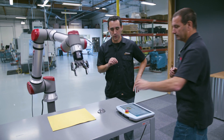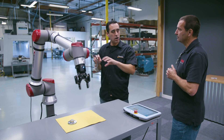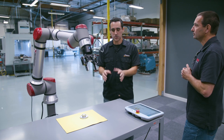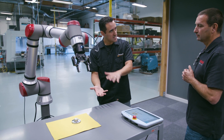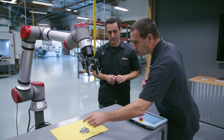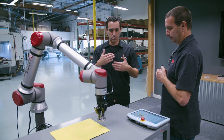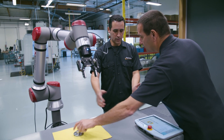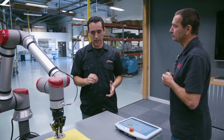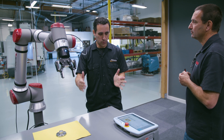So this solves the big problem I had four years ago. Every part I had, I made a plate with pins in it, put all the parts on it, and the robot would just go to where I told it regardless of whether the part was there or not. This is so much more simple — I can just put the parts on now. Is it a plane? Can I do stacks? You can do stacks, you can do planes, you can be at a different angle — it doesn't have to be planar. This alleviates all that pain. You could have multiple parts and the robot sees every single one at the same time. So I could load up a blue bin — maybe 16 or 20 parts — and it would take a picture of the entire bin and pick them.